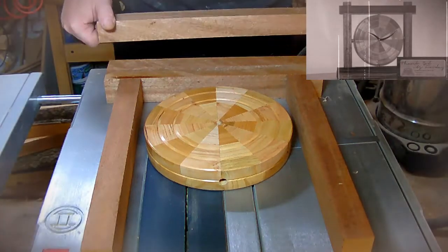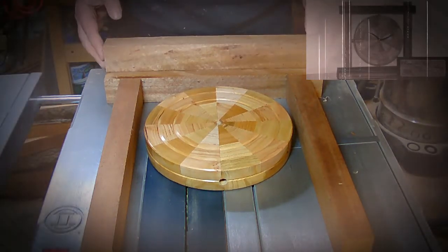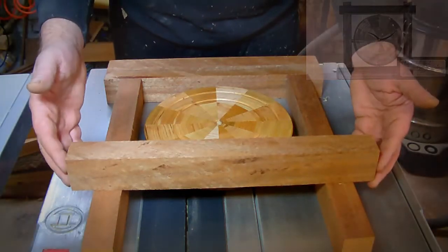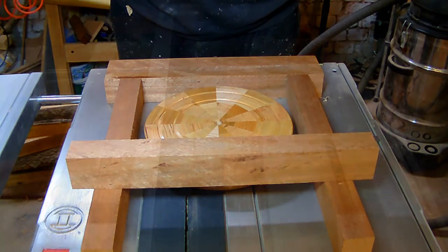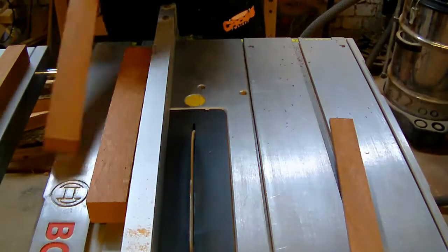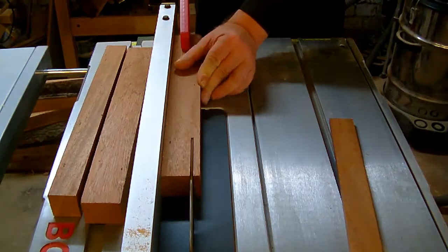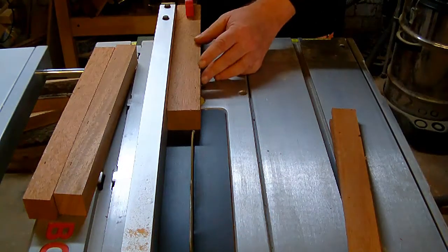The first layout of the reclaimed wood made me feel comfortable with the picture inside my head. I started to cut the stiles and the upper rail to their final dimensions, square, just about 5 mm thicker than the face of the clock.